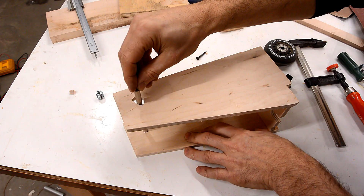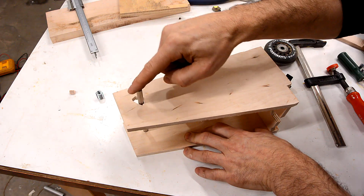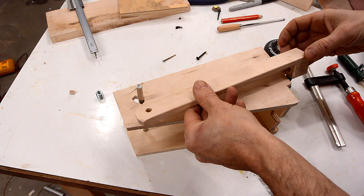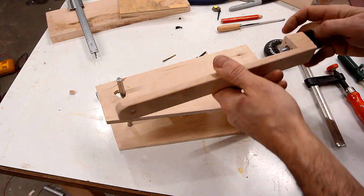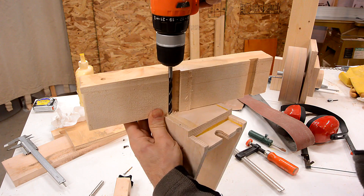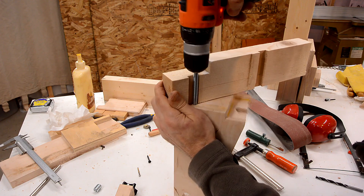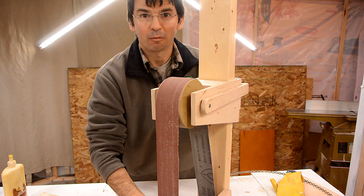The slot needs to go this way, so I've got this slot butchered out to go this way. And instead of pulling on this shaft to go up, I now need to push on it. So I'm still going to use this same part, but I'm going to have a knob in here that pulls it this way, which means I need a threaded hole right here. And now using a thread tap on that. I now have tracking control that works.